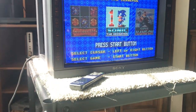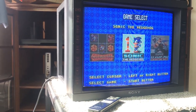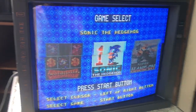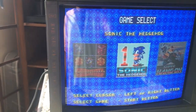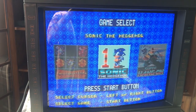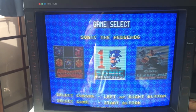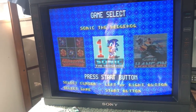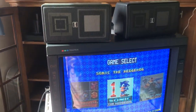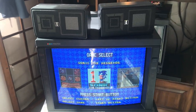The 20 M2 MDU is rated at 600 lines at 20 inches, and this monitor is rated at 540 lines, but it is sharper than the 20 M2 MDU. It has better colors, it's got a better tube in it. I've seen other PVM 2030s and they as well have better tubes. I've seen multiple 20 M2 MDUs and those just don't have as good tubes as these 2030s. Take all that TV line marketing with a grain of salt.